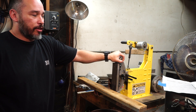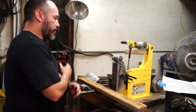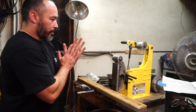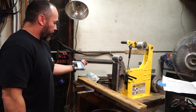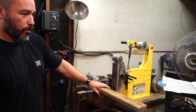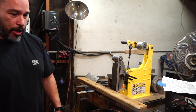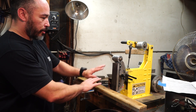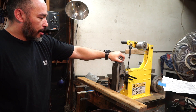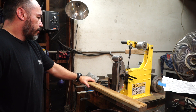As far as the grinder goes, it's pretty simple — slap on your belt, it's got the tension adjuster. What these grinders allow you to do is make your own tool rest. I've got my small wheel holder, the little tool rest for the small wheel holder, I made the big sword one that I use, and I made a new hollow grinding jig where you set it up on the wheel and spin your stuff around. I do believe they sell a new version that's slightly cheaper with plastic wheels — that option wasn't available when I bought mine, but now that I have it I'm sure the aluminum wheels last a lot longer, so it's worth it.